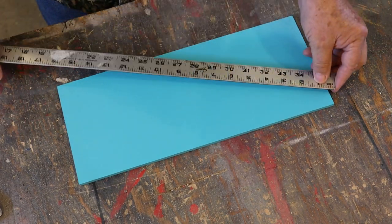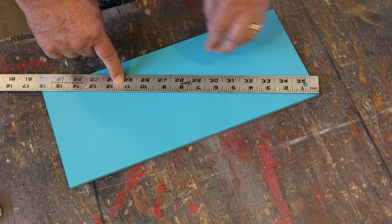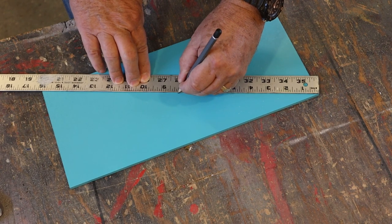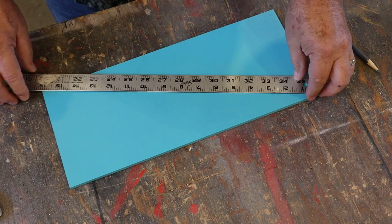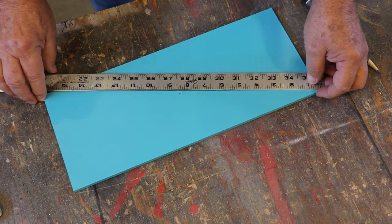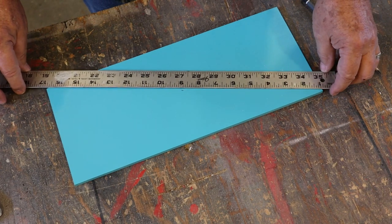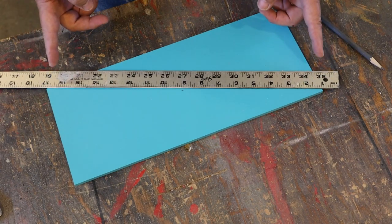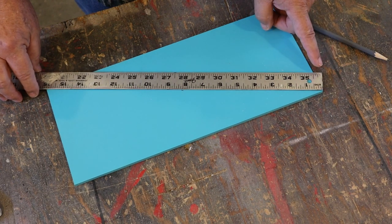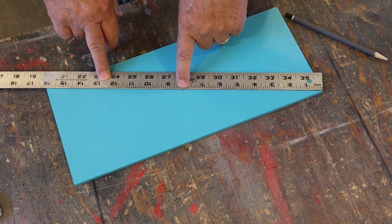You only need one measurement. Take a straight edge, start on an opposing corner, measure diagonal — in this case it happens to be 16 inches. Then put your mark right along the line at the halfway point. If it's a slightly odd size, you can adjust the ruler back and forth to overhang the same amount on either end, or start at zero at one corner, pivot until it hits the other corner, and do a little math to find the center point.